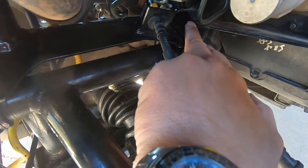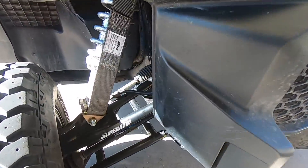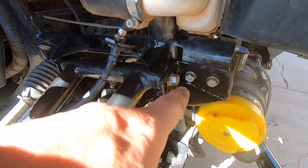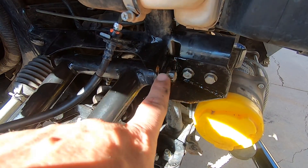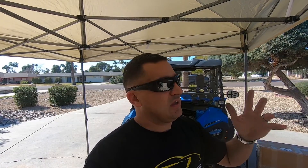It doesn't look factory because it's shinier, but I would say it looks pretty good. It's at least as thick as the factory metal, if not a little bit thicker. So it'll definitely help this A-arm from tearing. If I were to hit something heavy, I'd rather have a fusible link of a tie rod or the A-arm versus the frame. The other side did come out just a little bit different because I couldn't get this corner cleaned up — there's some anti-seize there. But again, they're custom made. I hope you enjoyed the video. I hope you go ahead and do something yourself, whether it's making brackets or whatever. Work with your hands, start wrenching — it's fun and for me it's therapeutic. Tune in next week to see the new bumper install. Don't forget to give me a big thumbs up, share, like, subscribe — click that subscribe button, ask your friends, help me out. Until next time.